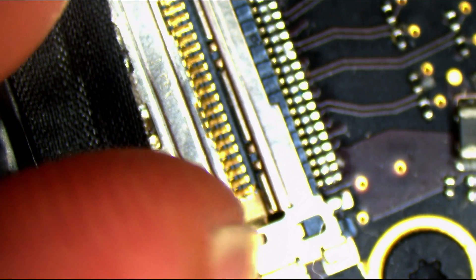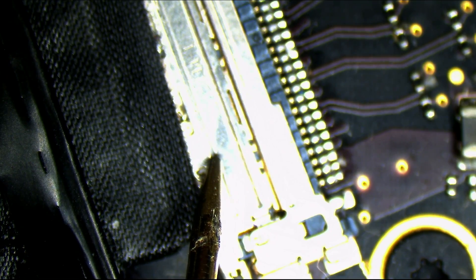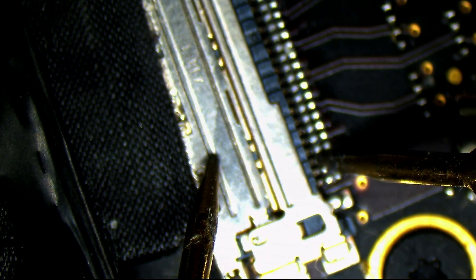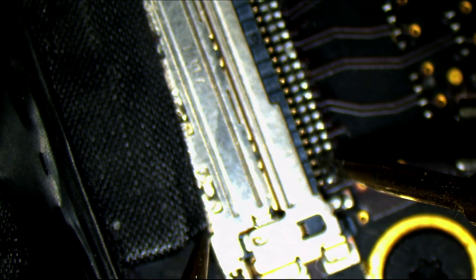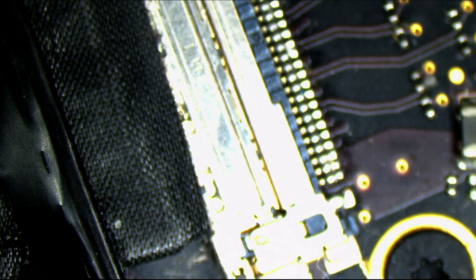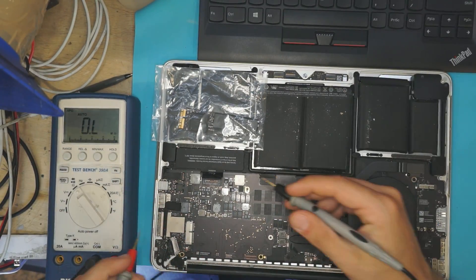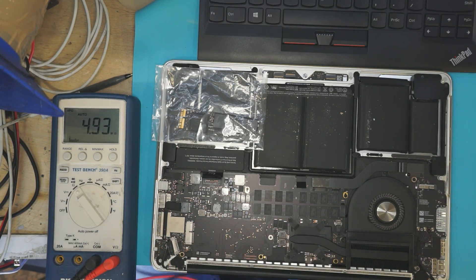So we've cut out those two nasty pins that were giving us our issues. Now I'm going to do one more measurement and see if this is still shorted to ground. Beautiful — we're not shorted anymore. We've got kilo-ohms. Unfortunately Paul Daniels' software is not working today so I can't have the multimeter on the screen, but yeah — 5.6 million ohms.